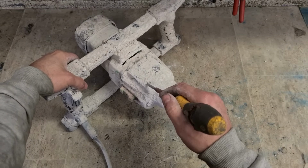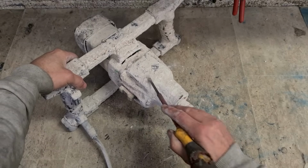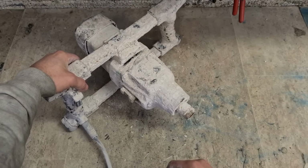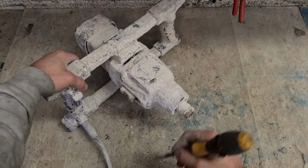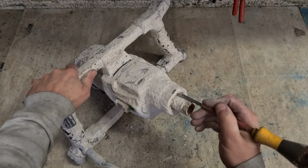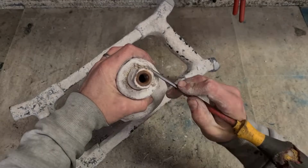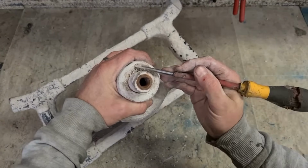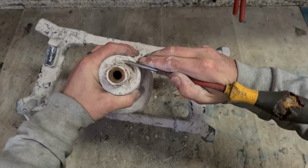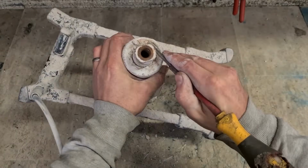That's it. They're quite heavy duty machines. They're very, very robust. All this build up, there's no harm to the machine at all. These can handle it. The main downside of having it like this is going to be this bearing. All that grit and cement and plaster builds up on the bearing. So that starts getting damp and wet, which starts to get onto the bearing itself, causing it to rust and eventually fail.